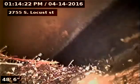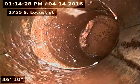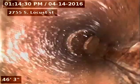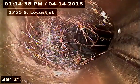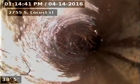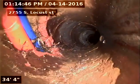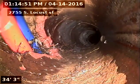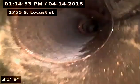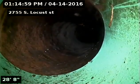City sewer at 47 feet. Slight offset at the tap. Got some heavy tree roots at 39. And then gas line bored through the sewer line at 34 feet. SDR to clay at 28 feet.